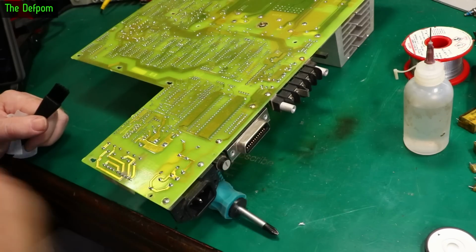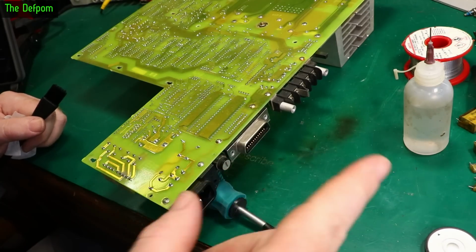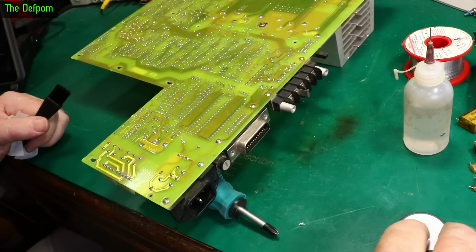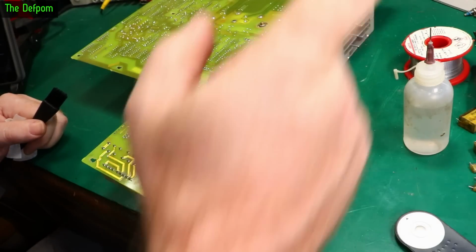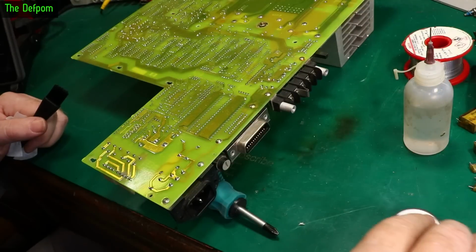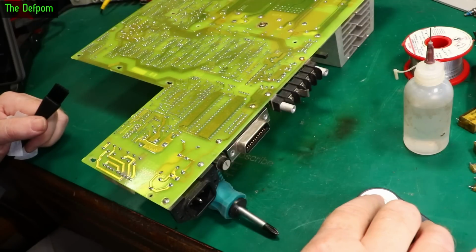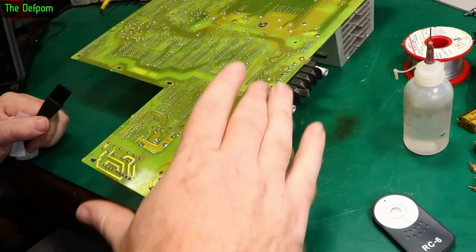And the other thing that's been pointed out in the chat is there's also a filter on the front of the unit inside the inlet that can be clogged as well. It's got multiple filters, so if it gets through the handpiece and gets into there because you haven't got the steel wool and stuff in there, or the cloth filter properly seated, it could get into the unit and clog that one instead. Bit of a tip. So that's that done, that's that cleaned up.